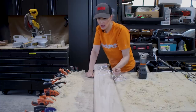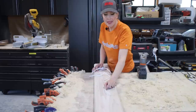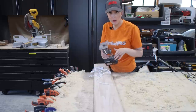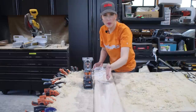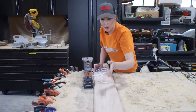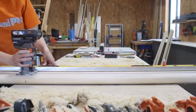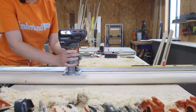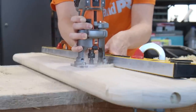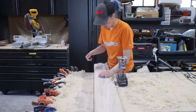It's a good idea to think about how I'm going to add my extension cord — basically how I'm going to run it up the length of the lamp. My idea is to drill a hole through the very top of the center board and then use a router with a straight cut bit to cut a dado — half inch by three-eighths inch — all the way down until I get close to the bottom of my center board, then maybe drill a hole so it can come out the center. I'll use my little trim router, which will give me a nice little channel to run my electrical cord through. Once I glue these boards together, everything will be hidden and all you'll see is the cord coming out the bottom.